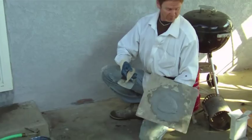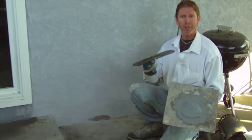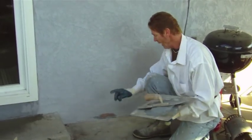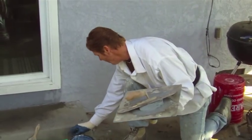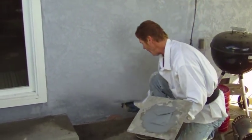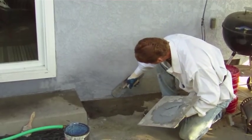That took about five minutes to mix up a quarter of the box — I still have quite a bit left which I'll just toss. For this little itty-bitty patch I only need a little bit. The tricky part: if I patch this without wetting the wall first, when it dries it'll be an eyesore — either four shades lighter or four shades darker. So now that the bonding agent is dry, I hit it with water, then apply the color coat — just touch it up like this, put a little texture on it.